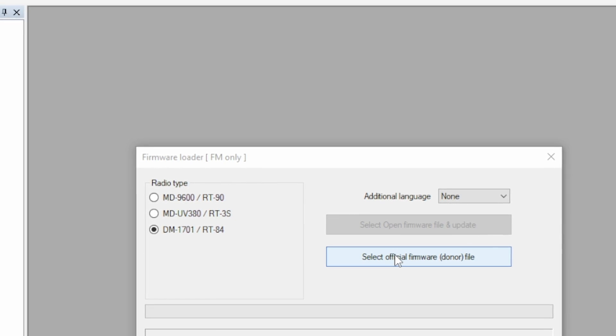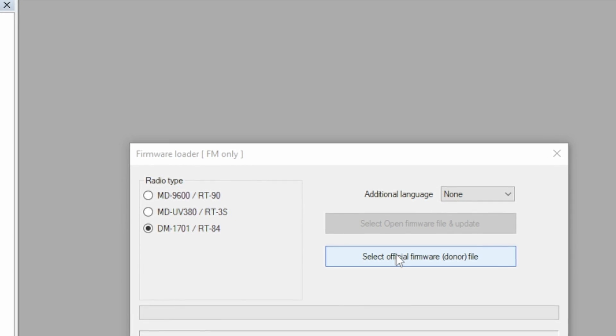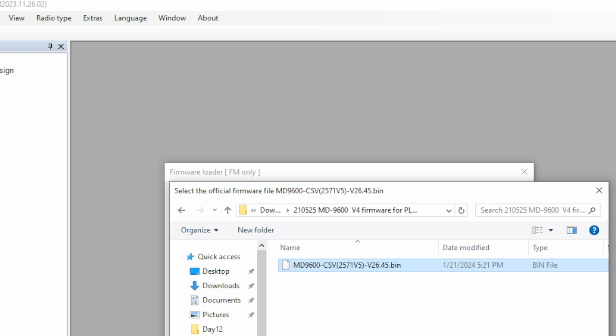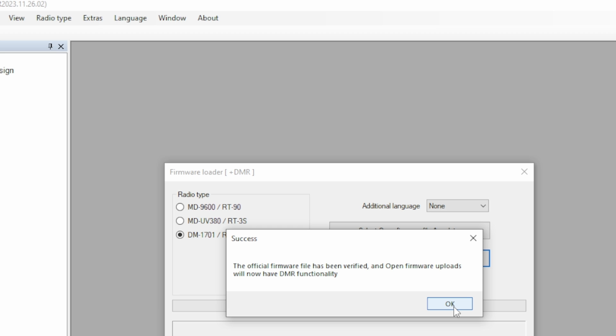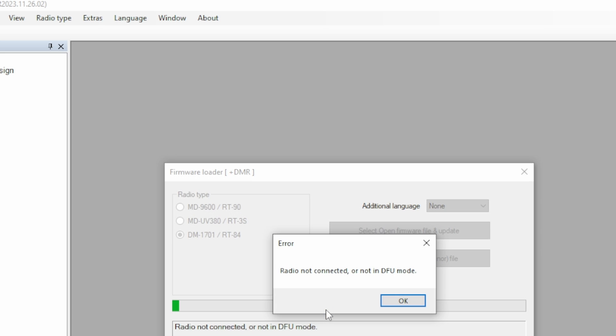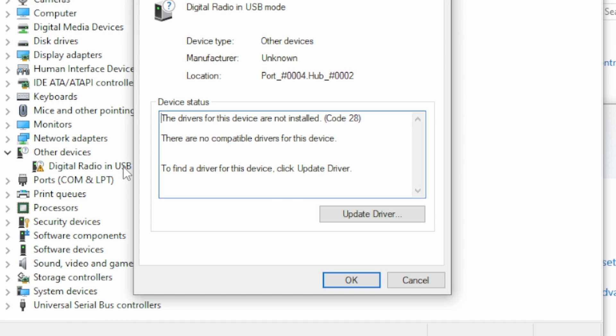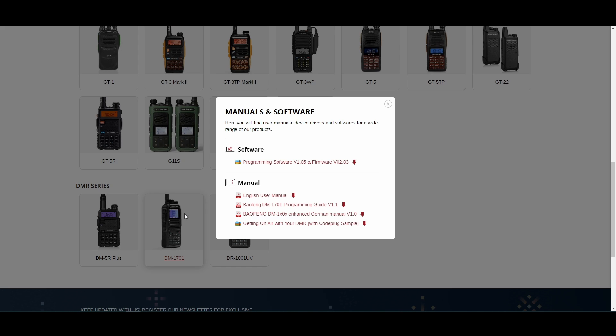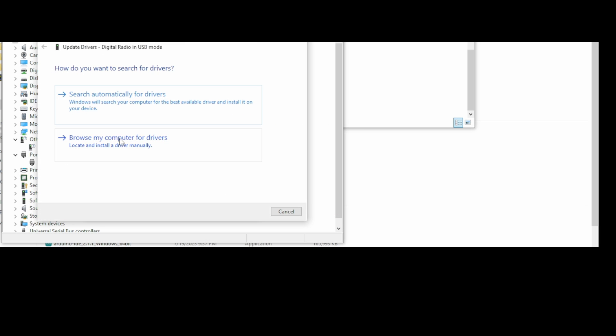So I did not have that, so I had to look around. I'll save you the mess of looking at that, but I'll put a link in the description to the one I used — I basically looked for an MD9600 one, and that was fine to use as my donor firmware. Here you can see where I'm navigating to where I unzipped that, I apply it, and I get the message saying it's okay. Now the radio will have DMR functionality. I then used the other option to point at my open firmware and got that, but then I was greeted with an error message after I tried to apply it. I found this in the Device Manager where it looked like I needed a driver — it might explain something I missed when I saw that driver install hang up earlier.